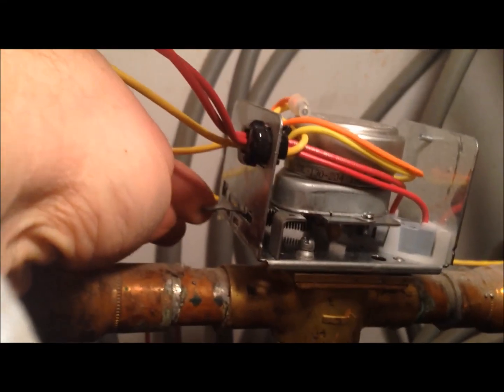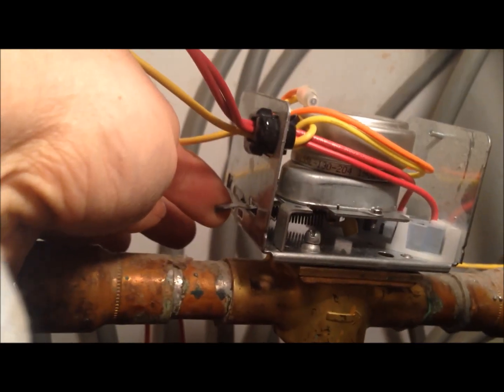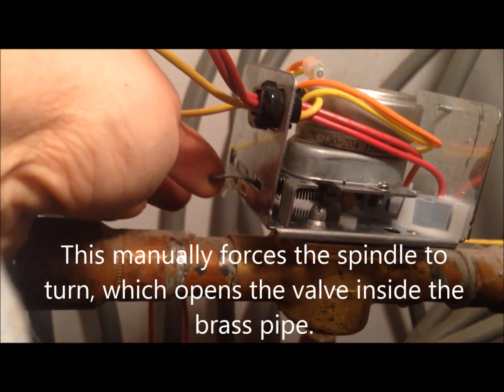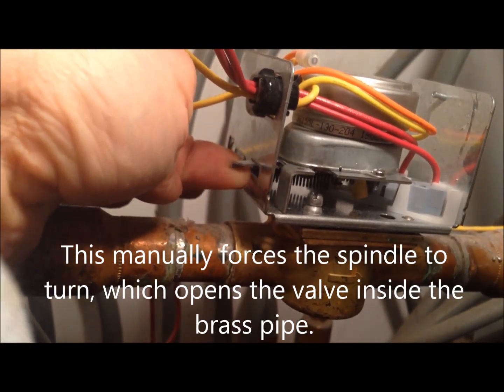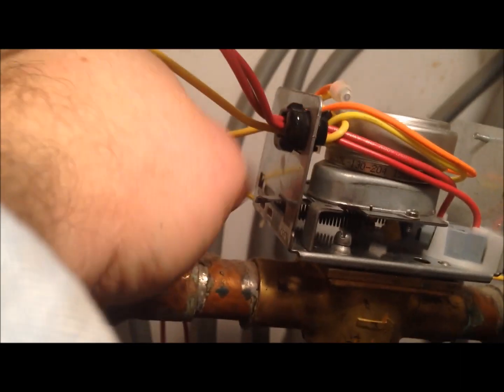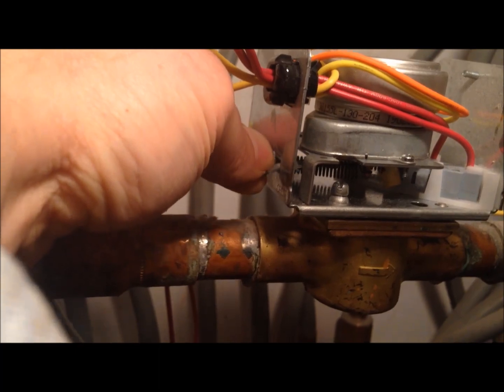The way this works: there's a little lever. If you pull it, you can actually hear it go back. What I'm doing is manually opening the valve. If you pop that lever up, you can manually keep the valve open, and no matter what you do to the thermostat, that valve remains open. If you want to go back to auto mode, you flip it down.